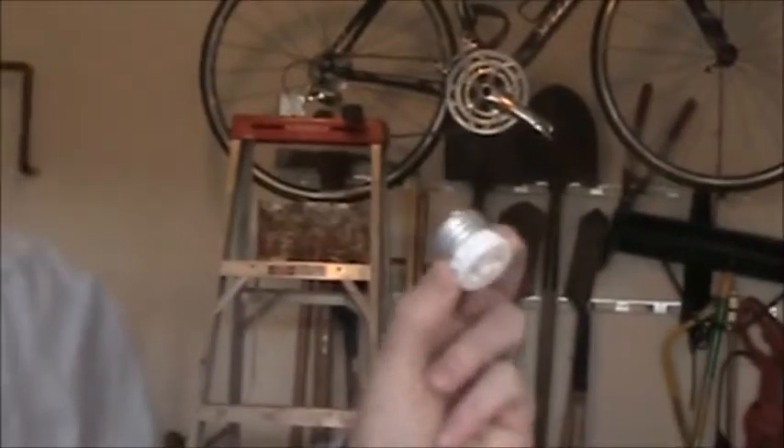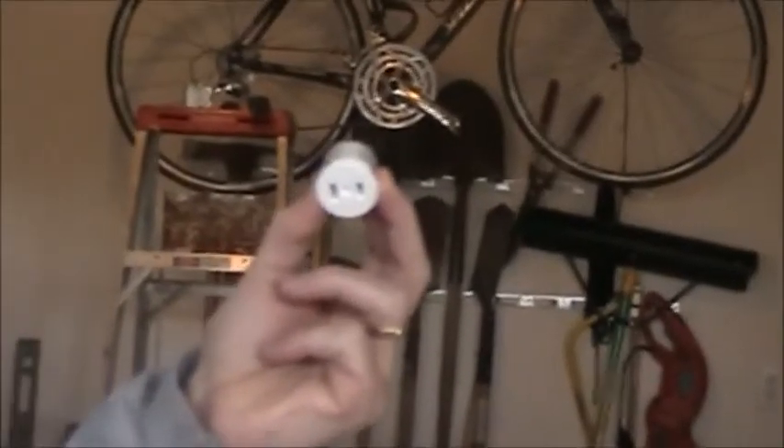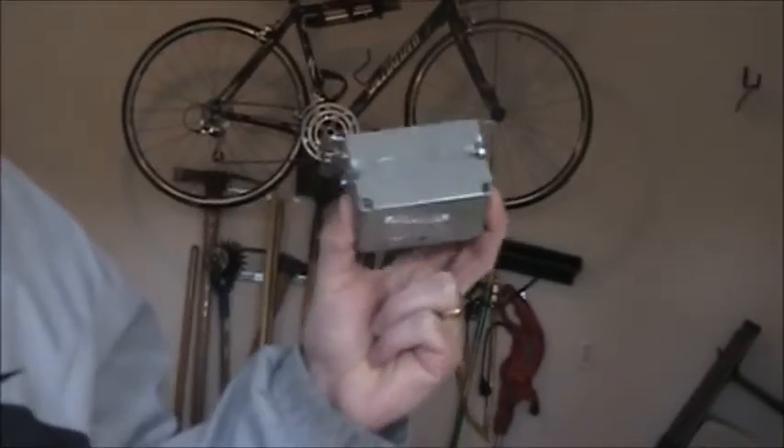We're going to start with this little outlet adapter that will allow us to plug a cord into the socket that runs the lightbulb for our garage door opener. We'll put our adapter right in the lightbulb socket, and that way it makes it easy to back things out and put your incandescent bulb back in in case of emergency. Now we're going to use this little junction box to make our 120 volt AC connections up above our garage door opener, and it'll help us keep things safe.